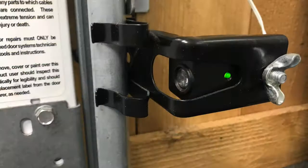There are all different kinds of safety sensors. This one is actually for a Genie — the Genie universal type. A more common one is this type of safety sensor, which can be used for your Chamberlain, Craftsman, or LiftMaster units. They fit on a bracket with a butterfly nut and are adjustable up and down, in and out.